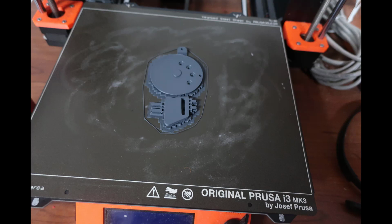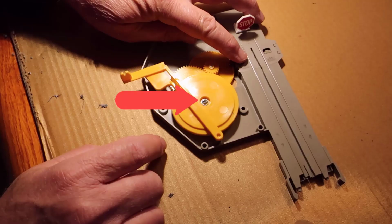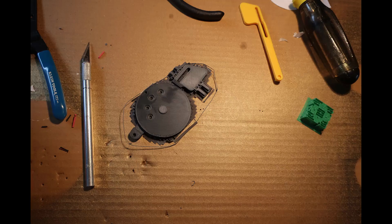About 5/16 in diameter, about 1/8 inch deep, to give me a little bit of room where the screw goes in on the operating log rolling bulldozer itself, and you'll see that silver screw inside the yellow wheel. The 3D print is now off on my little work area, which allows me to imprint things using corrugated cardboard so that they stay. You've got to strip this off, and because I'm using ABS and the resolution of my printer, I've got to do a little bit of filing to make these things smooth, and that showed up as assembly came into play.